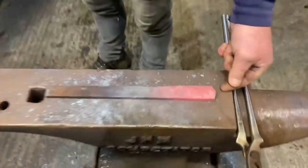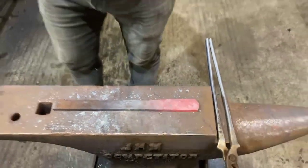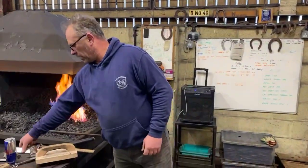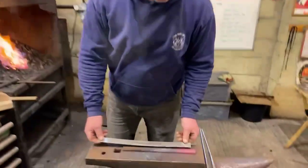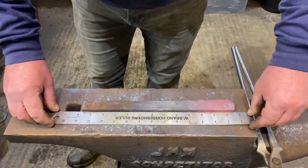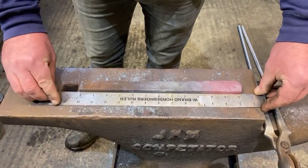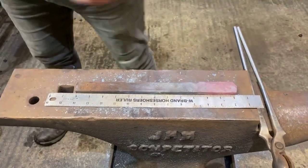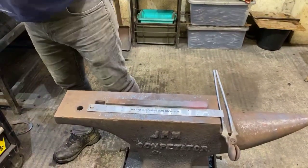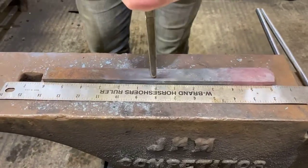So as you can see there, we've got a stone trap here and our reverse heel check there. Again, I'm not over-angulating it because I can always change up a rasp at the end. Right, so I should have 12.5 inches. At this point, I know when I fit this, I need to fit it slightly longer on the outside for it to work, because I've got to come out and support a foot which isn't there. So, again, mark it off centre.